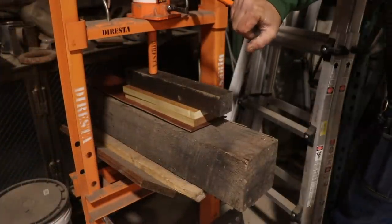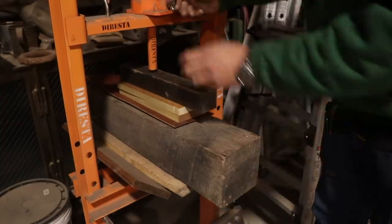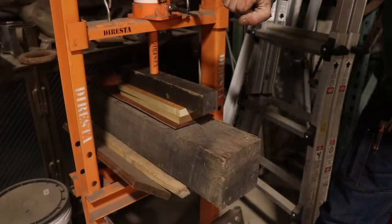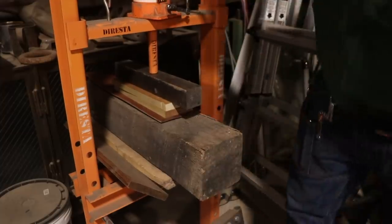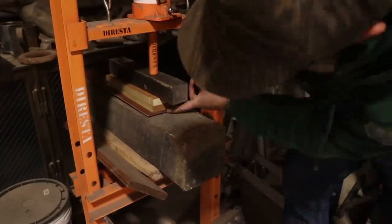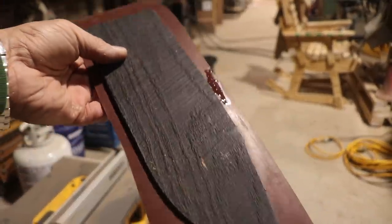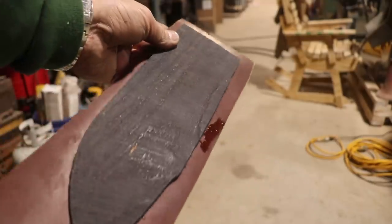So I said, before I abandon this idea let me try it on my arbor press — this is just a hydraulic press I got from Harbor Freight, I think it was $125 when I bought it several years ago. You see the stack of wood on there — that's just to distribute the weight. That big chunk of steel is also to distribute the pressure. If I put it directly on the back of the leather I'd get impressions right where it pushes. And you see how much better it worked with a couple of thousand pounds of pressure versus whatever I got from just that grouping of hand clamps.